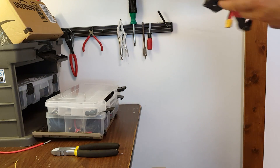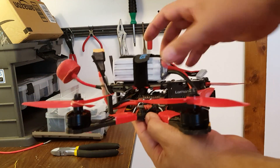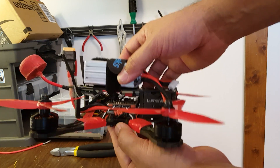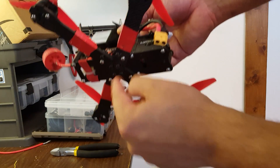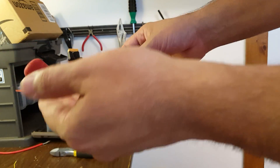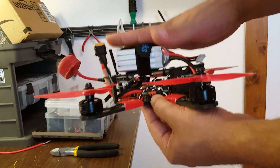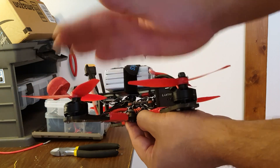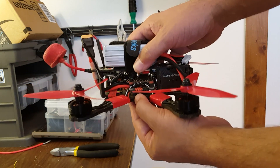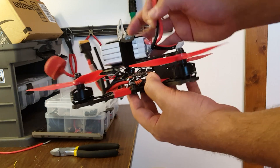What's interesting is that a copter like this looks like the CG might be very high, but in fact it's not that far off. You can do the same thing with a copter with an underslung battery and find it's a little bit low, but the difference is really subtle. I think some of the fuss about getting the CG exactly on the prop line may be a little bit of concern over nothing — though maybe I need to do some flight testing to find out if there's more to it than I thought.